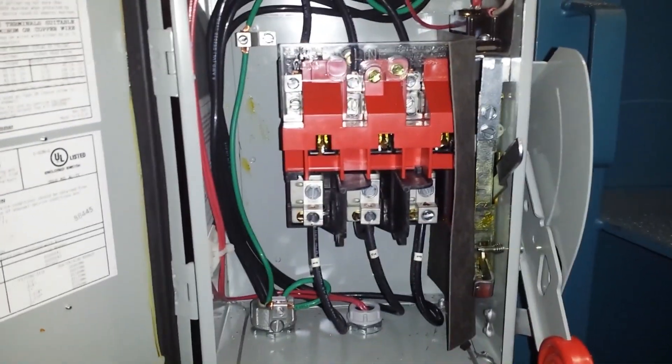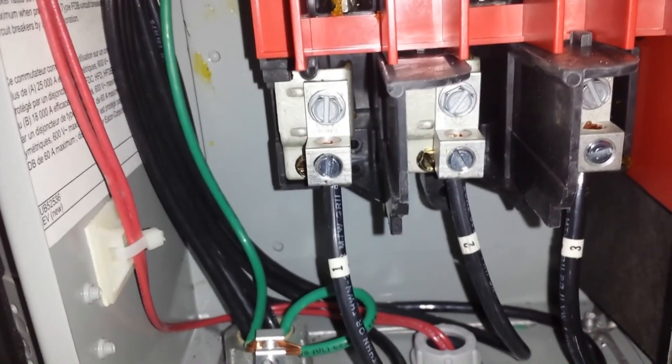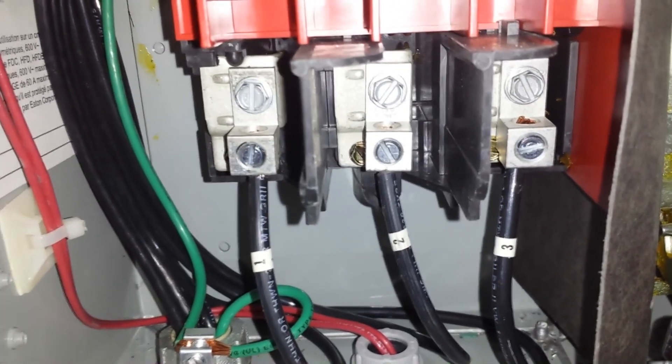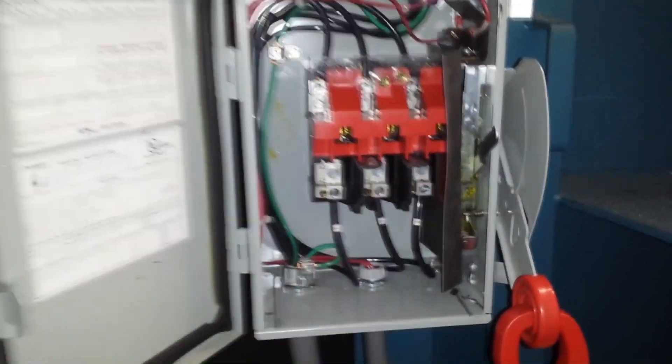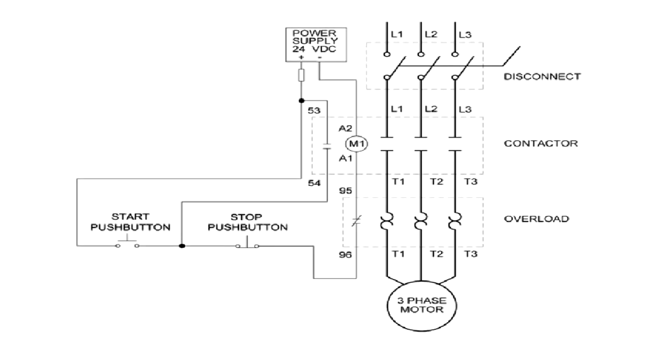What the simple drawing fails to show you is the correct order of the three-phase system and how it's usually set up. The disconnect is usually close to the motor, especially in modern buildings — disconnects are located close to motors for safety reasons, and they also make troubleshooting easier. Let's start at the nearest disconnect. Before turning the disconnect off, turn the motor off. Never throw a disconnect under load. With the power off, check for incoming line voltage by checking phase-to-phase voltage. Most three-phase systems in the United States use 480V — the meter will read something close, maybe 470 or 477.